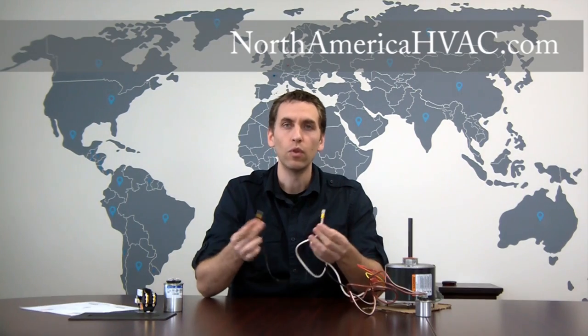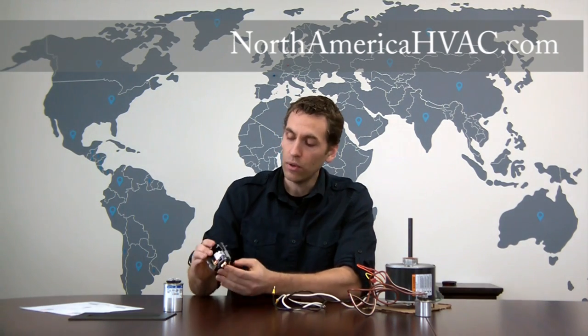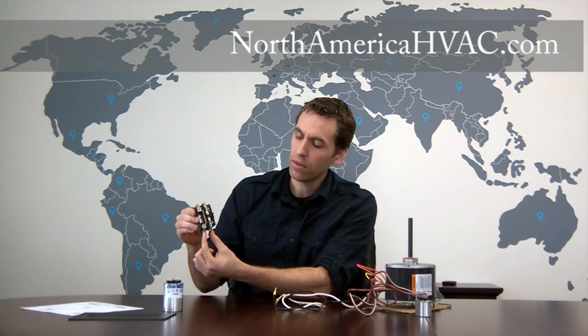That leaves you with just two wires left, normally a black one and a white one. What you're going to do is hook those to your AC condenser contactor relay. You need to look at the relay and see which side the incoming high voltage wires are on. Normally at the bottom you'll have two wires coming in connecting to an external source to power your unit, so you'll want to go to the top side of your contactor — the opposite side of the power wires.